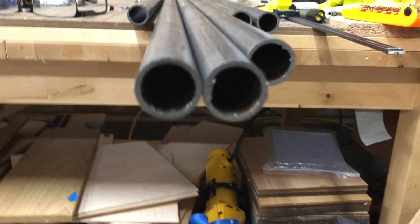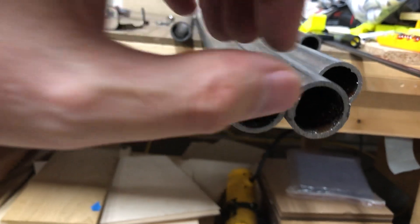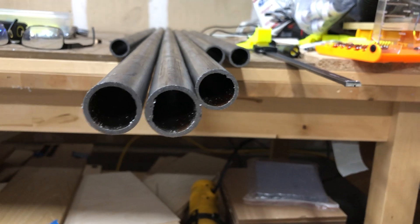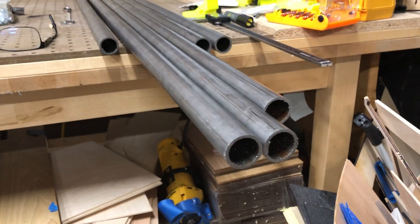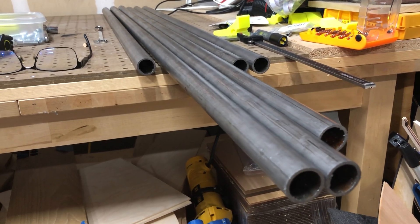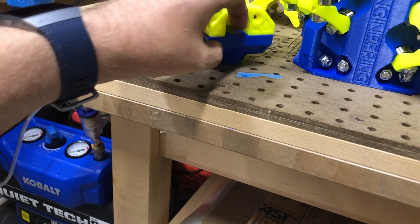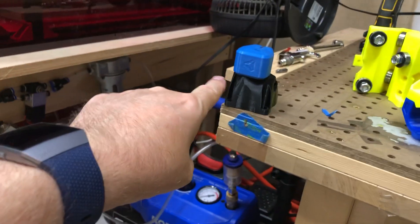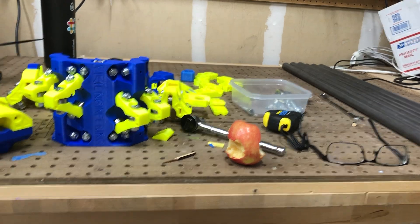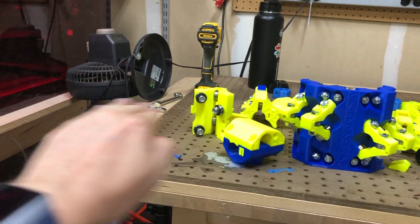This is the 0.085-inch wall thickness, which is in between the two settings Ryan spec'd out — he spec'd a wall thickness of 0.065 to 0.120. Metals Depot happened to have an in-between, so I thought I'd split the difference and go with it. All of my pipes are exactly the size I wanted, plus or minus a millimeter. For most lengths that doesn't matter — they could be two or three millimeters off and still be fine, since they'll just stick out a little or come up slightly shy. The critical dimensions are the height pieces — you want the height to match and the Z to match, otherwise you could have interferences with parts or your pipes won't be true and level to the table.